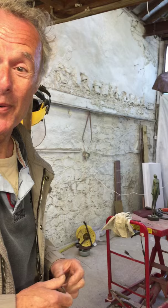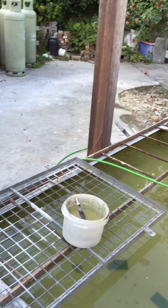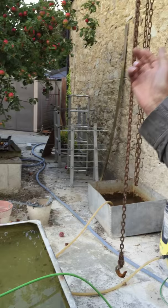This is the simple room where I will very shortly be making many figures for Tasmania, and I'm so excited about that — that's the real thing I'm looking forward to. These sculptures are now part of the past and I'm looking forward to the next project. Outside, when the metal is poured into the plaster molds, the best way to remove the mold from the bronze without doing any damage is to put the mold into water so the plaster starts to dissolve and fall off into the bottom of this tank.